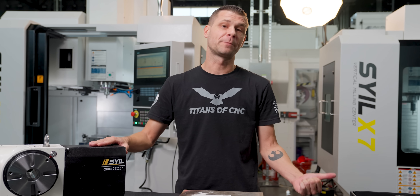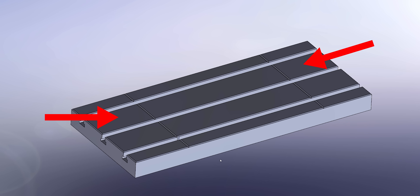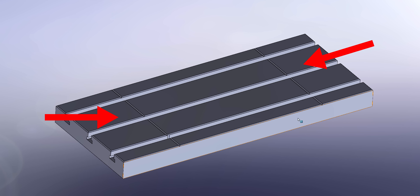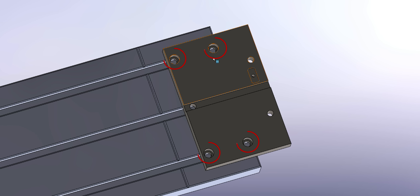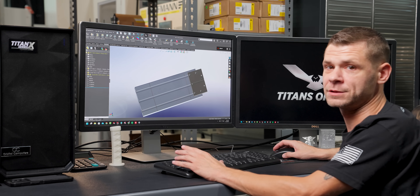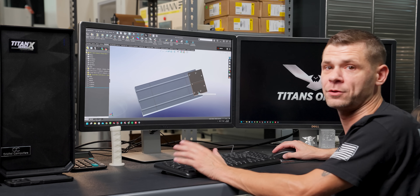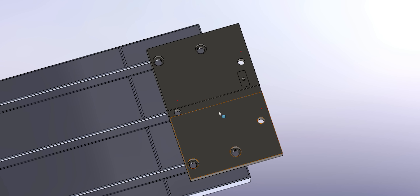To give you a better visual of how this is going to be mounted, we're going to walk over to the computer and open up the setup in SolidCAM. These two lines represent the maximum travel in X in our machine. We have four counter bore holes on the fixture plate to mount the plate down through the T-slots onto the table. The two keyways — one down to center and one slot — are for aligning the rotary in X and Y, and the three remaining holes are used to clamp the rotary to the fixture plate.